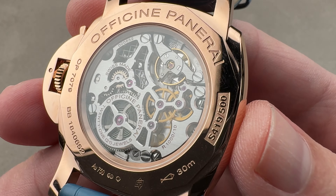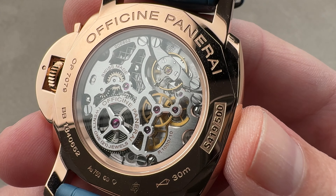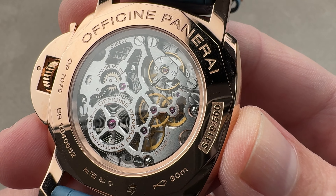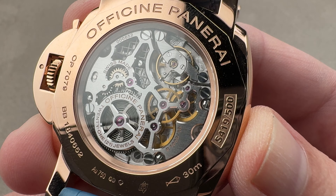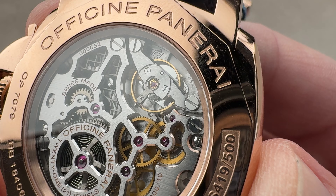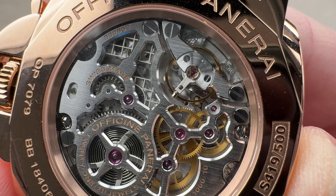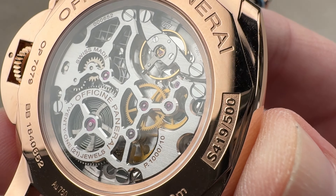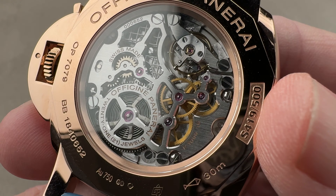Turn it over. We have the P1000 — actually this is the P1000/10, which is the skeleton version. It's a big upgrade over the older P999: manual wind, one barrel, three days of power reserve, and a four hertz beat rate rather than three hertz. You can see it is heavily skeletonized, and while the finishing is mechanical, it's also clean, attractive, and appropriate — it feels upscale. It's built like a sports watch movement with a free-sprung balance and a full balance bridge to make it more shock tolerant. You can see various design details: the grills, the openings, the coiling of the mainspring which acts almost like a power reserve surrogate. We have engine turning on the base plate, polished screws, satination across the bridges, and then beveling and satination on the wheels — a good looking movement.